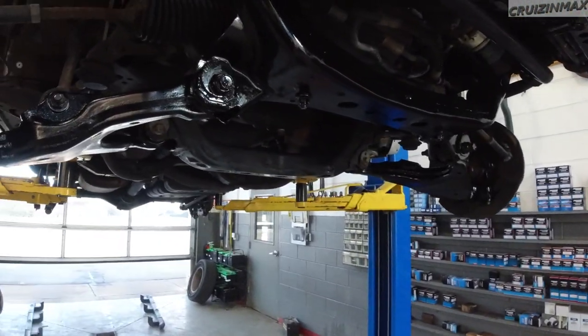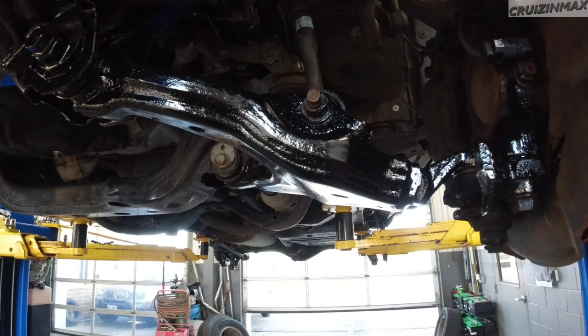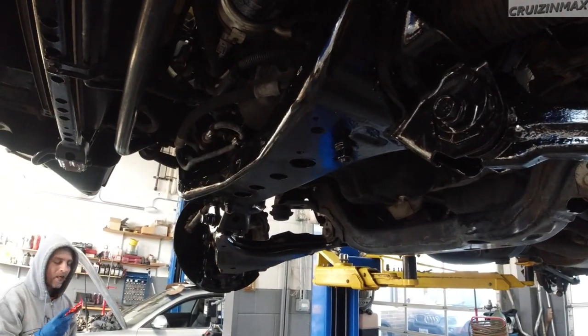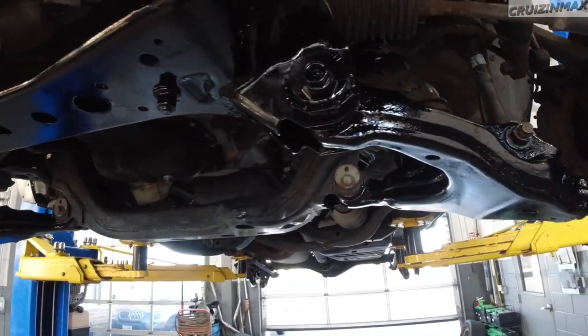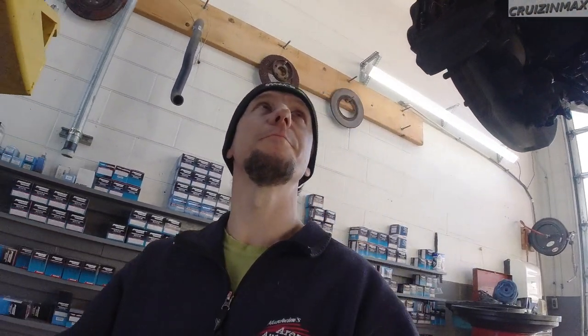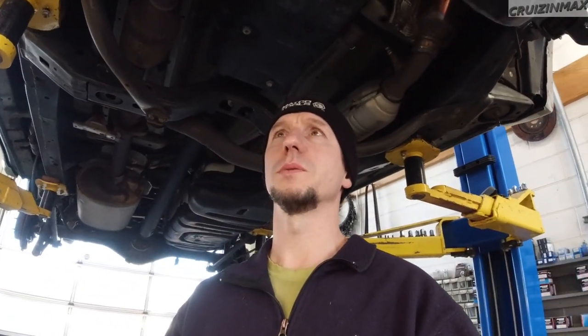Lucas is taking a break. This is what the paint looks like — it goes on thick. Make sure you don't go too thick; just dip the brush in a little bit and spread it out. Thick coats will bubble up. This paint dries with humidity — it uses humidity to cure — so if it's a very humid day it's gonna dry too quick, which is a no-no. If you're in Florida, wait till winter time.